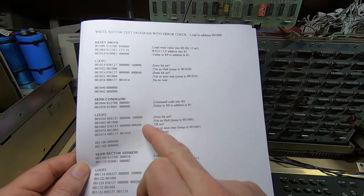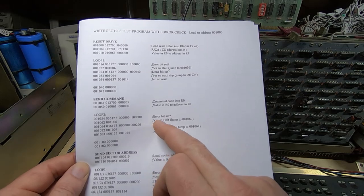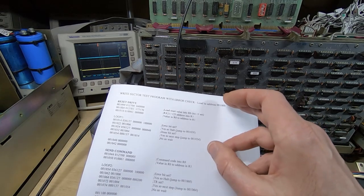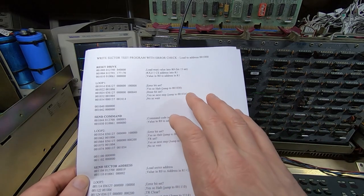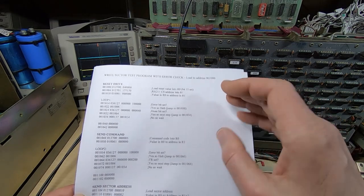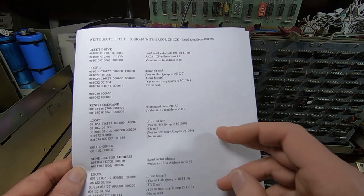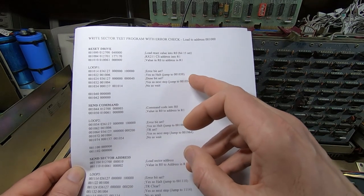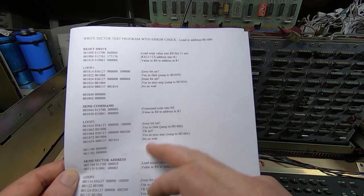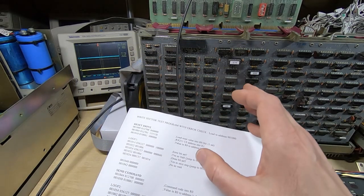And the reason I don't do that in these test programs is if you make a call to a subroutine, then the CPU does some housekeeping. It pushes the return address, program status word, etc. onto the stack. So firstly, you need to initialize the stack. It's not difficult, but it's an extra step. But also, when I run these programs, I want to use them in conjunction with the logic analyzer. And if you have lots of function calls, then what you end up with on the logic analyzer is a bit of a harder sequence to follow, because part of what you're looking at are the housekeeping steps made by the CPU.